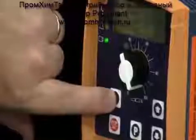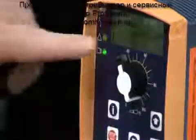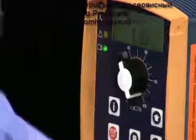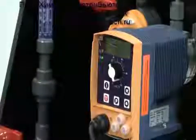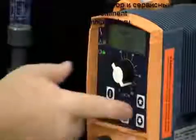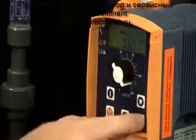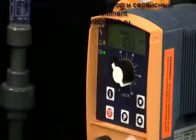With the display, I can scroll through and show the pumping rate. At this setting, I'm pumping about 1.09 gallons per hour. I can pump again from my true volume amount, and if I need to adjust that, I can lower it by changing the stroke length as well as changing the speed of the pump. Now I'm right at 1.02, and I can lower it a little further to be right at 1.0 gallons per hour.